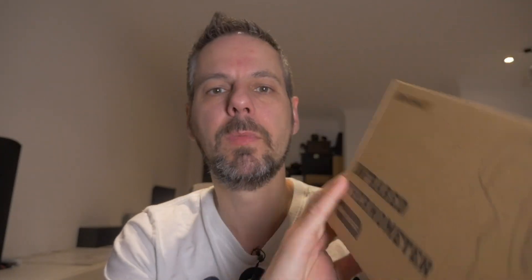Let's talk about what we've got. We've got an infrared thermometer. Sometimes you can get pyrometers, which you actually put into your forge to measure the temperature. I've been after a laser infrared thermometer for a little while, because I don't actually want to leave a pyrometer in the forge. I want to use a laser to point at the forge to measure not only the forge temperature, but anything I put in there.